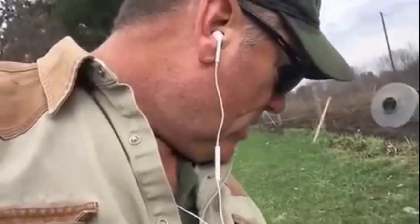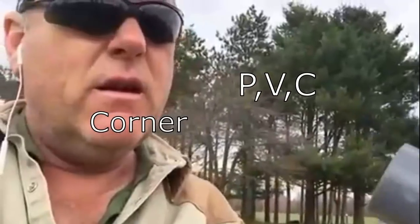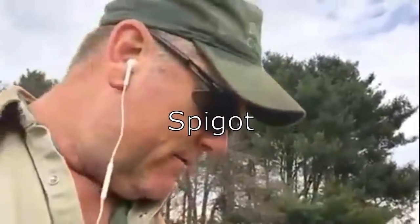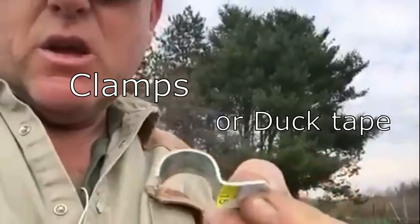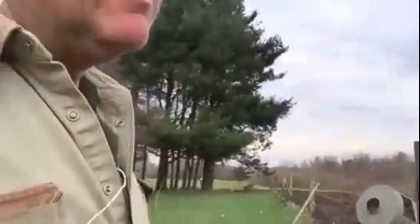Here's what we have — we need this piece here, that's a corner, and you can see it's threaded three-quarter inch for one of these. This is a spigot — spelled s-p-i-g-o-t. And then these fence clamps right here — you don't have to use these, you can use duct tape or wire, but these give a nice professional appearance. You put a screw into the fence post the line is going to run up.